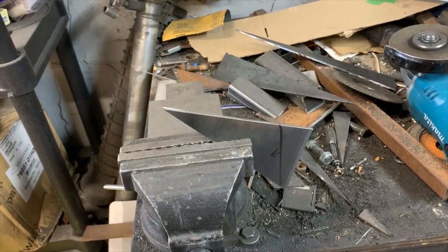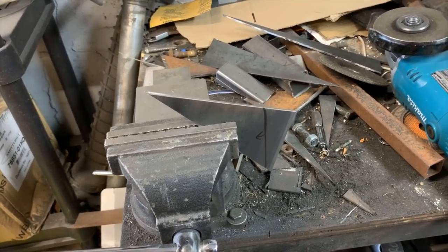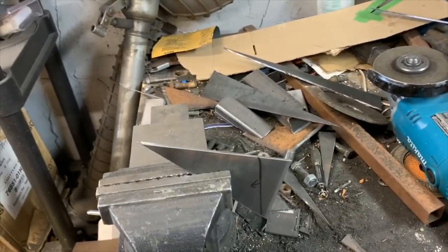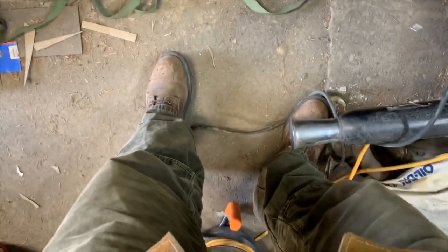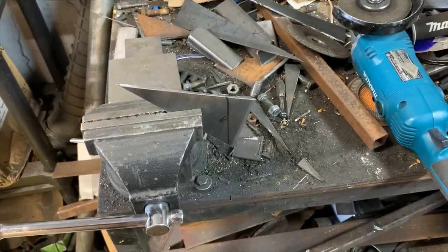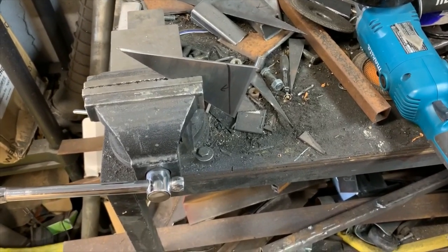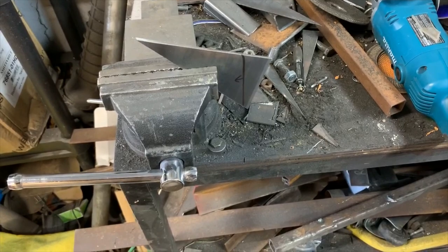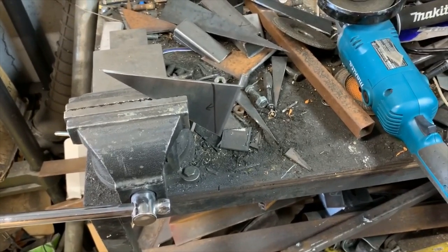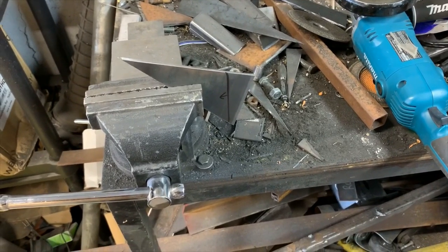We let gravity do the work, and we're pretty good at lining it up, and you get a pretty good sight with it. Granted, you'll be using a face shield. You might find your face is getting a bit of sparks. Things to watch out for. Look at these things down here. Those are my legs. My legs have pants on them. These pants are cotton-based and should smolder when ignited. I also don't really want to blow holes in my pants or catch my pants on fire. So, make sure your legs stay out of the spray of sparks there.